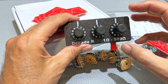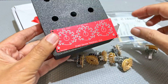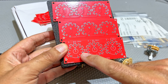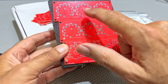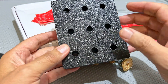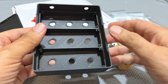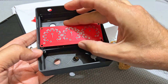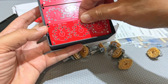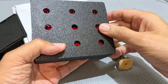This is the small version, but I've also made a big version which allows you to put three of these modules in series inside. That means you can have 1 ohm, 10 ohm, 100 ohm, 1k, 10k, 100k, 1 meg, 10 meg, 100 meg if you want to go that far. The enclosure is designed to receive three of these boards perfectly in those little indents, so they definitely won't rattle, and when you bolt the switches to the front it holds everything perfectly.